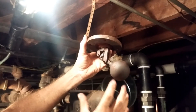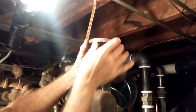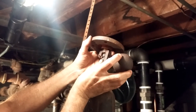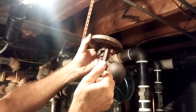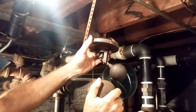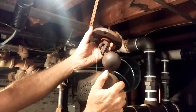What happens is, if the water rises up into this chamber — which is a cast iron container — it will rise up and the plunger will, or should, prevent water from squirting out of the system. When the water drops down, it opens up to allow air to escape. And that is what this is supposed to do. This was one of the first systems they came up with in the coal era to keep the water from squirting out all over your basement when they lost control of the pressure.